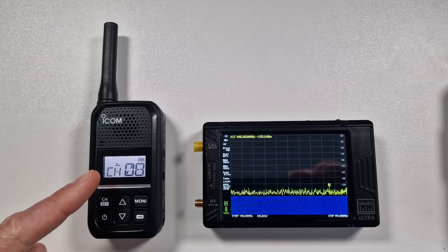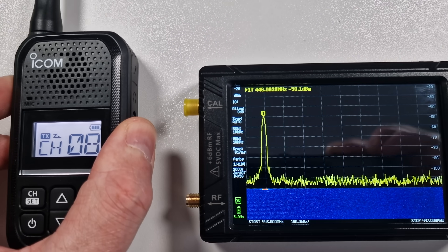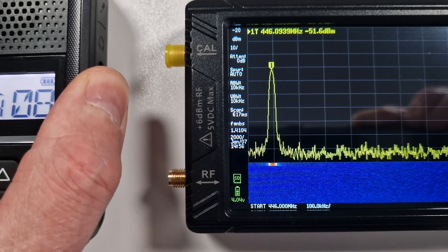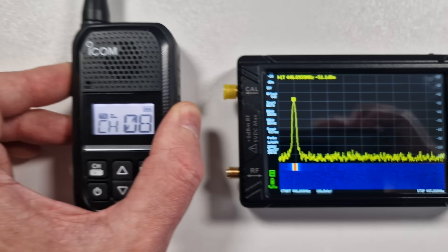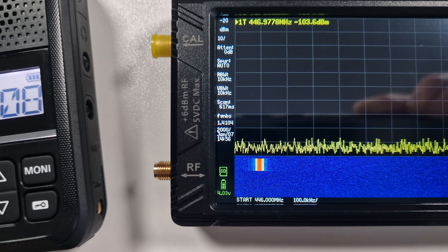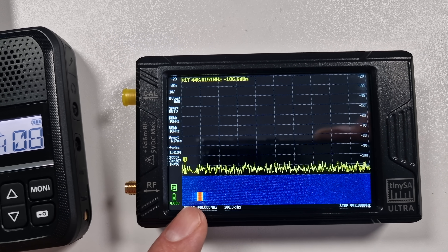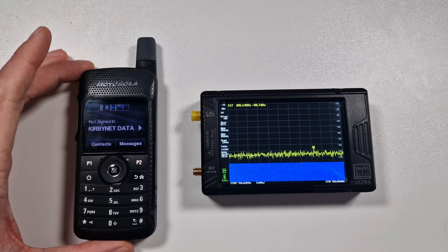Not only is this little radio super easy to intercept, when you actually transmit you'll see a wave here and then you'll actually see a trace. See that there? And if we release the button so we're not transmitting anymore, we see that that goes away. But that is leaving a trace because we can see that there was a signal there a little while ago. So this little spectrum analyzer is capturing data over time so it can see activity in a particular area or part of the spectrum.